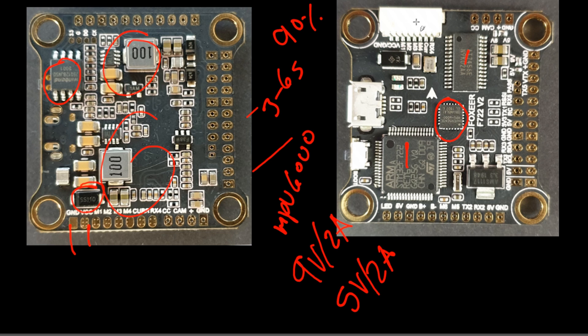For connections, if you want to plug in a 4-in-1 ESC you have a connector, but on the bottom side you also have access to every single pad of that connector, so you could solder directly or use the connector. We also have RX4 for telemetry, VCC, and ground — because this board takes battery voltage and needs something higher than 9V to step down to 9V.